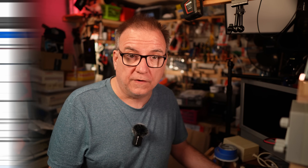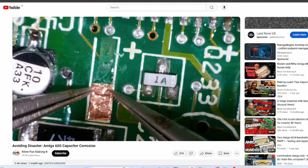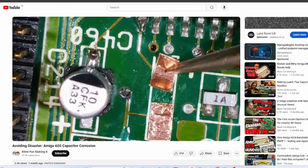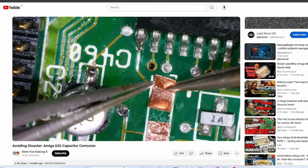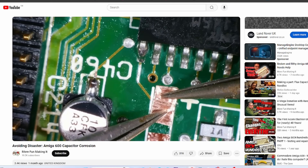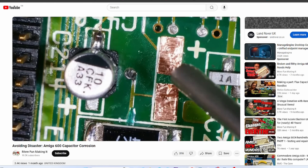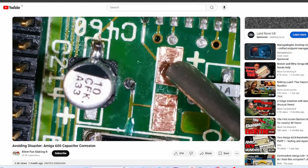Recently I've made a couple of repair videos on Amiga 600s, the 1200's little sibling. Whilst making those videos, my journey to greater desoldering knowledge took a large leap forward after a big nasty shock when some of the pads under the SMD caps decided to detach. I fixed them up nicely and I'm happy with the result, but what I learned that day was that hot air was going to be my friend going forwards. I had experimented with different methods — I even tried mechanically twisting them off with pliers just to see what happened.